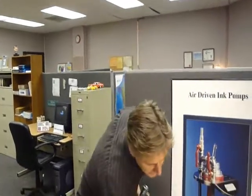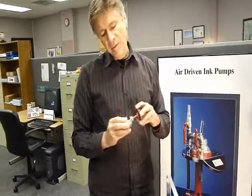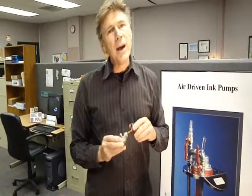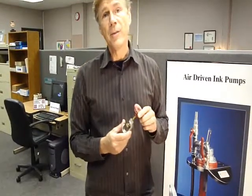When you look down here, you get a full three quarter inch full flow bore. Some people would use something like a pinch valve, but the problem with these is you're squeezing the tubing and therefore adding resistance to the pump discharge. You don't get good fine control with a valve like this, and also you're stressing the tube valve.